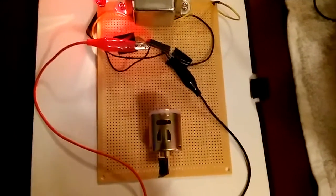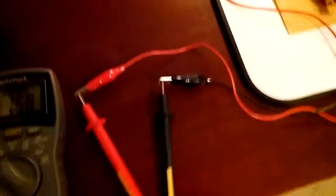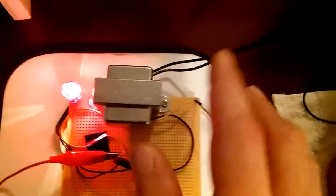So it's really cool — if you unplug it, it cuts off; if you plug it in, it cuts back on. From there, I just want to show you guys that it does work — so we'll disconnect that and hook up to our motor. As you can see, it's really that easy. Most of the time you'll buy the transformer and it won't have a wire attached, so just find an old PC wire or an old electrical wire that's 120 volts AC, cut it off, connect it here, and solder it. If you're not able to solder, twist the wires together the best you can, then electrical tape each one individually and then tape them completely around so they don't touch each other — and so you don't touch them either, because 120 AC is not going to kill you but it's definitely not going to feel good.